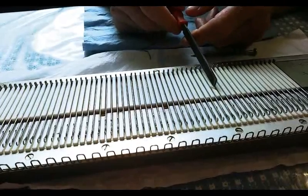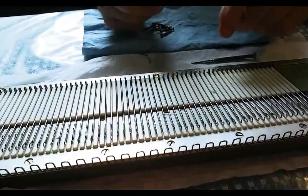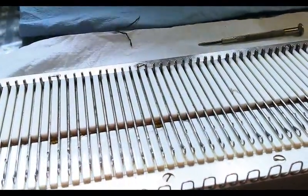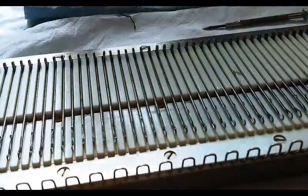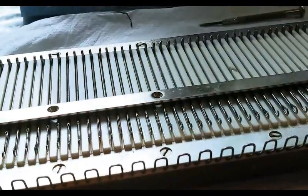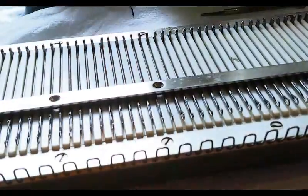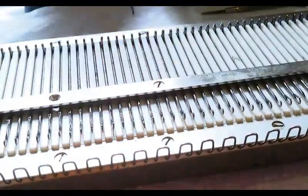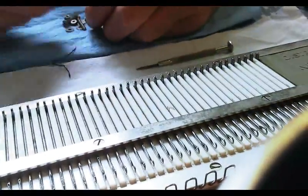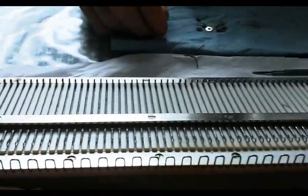Anytime you use this polymer compound it hardens quickly but it can be sanded, so he smoothed it out and was careful not to damage the bed material. Here is the rail going back on — its positioning is pretty obvious. We need to remind ourselves that the screw goes in from the top and then a flat washer and a nut on the other side. The best thing to do, as Katherine has said on camera many times, is test-fit everything before you tighten anything so that you know everything gets aligned just right.